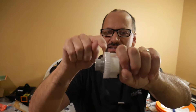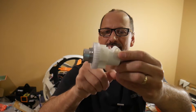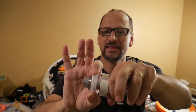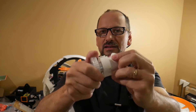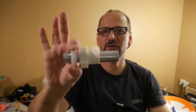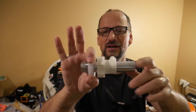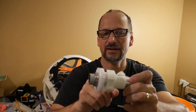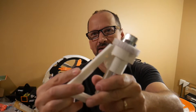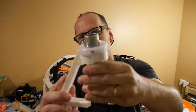That really clamps everything to the tube and puts it all together nicely. I don't actually connect this pulley mechanically to the extended hub. The reason for that is if things get crazy and this turns or twists, things will get a little loose and maybe slide, but they're not going to break. It will fail very gracefully — it's not going to snap and fall off, it's just going to loosen up. Hopefully everything stays tight, and there are things we can do to lock it all together, like thread lock and so on.